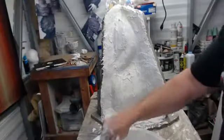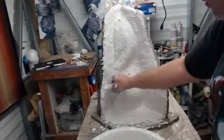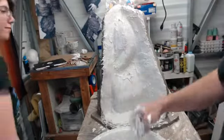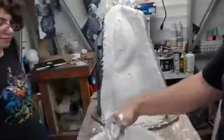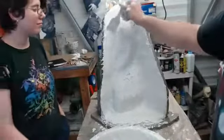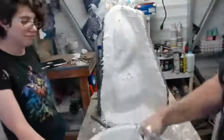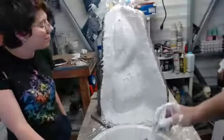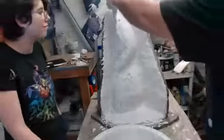And that's regardless of whatever material you're using, whether you're using epoxy or fiberglass resin, whatever. Even silicone, it doesn't necessarily have a mold wall per se, but if your mold isn't thick enough, you're going to have all sorts of uneven wear and heat wear.